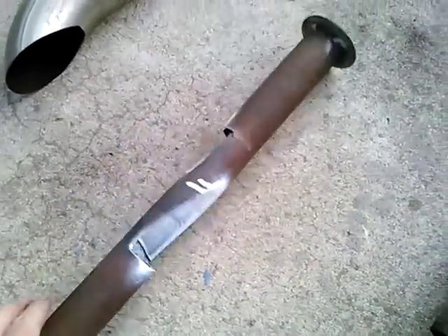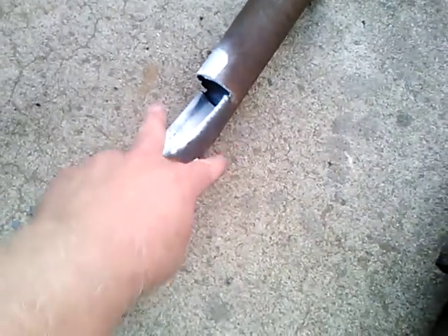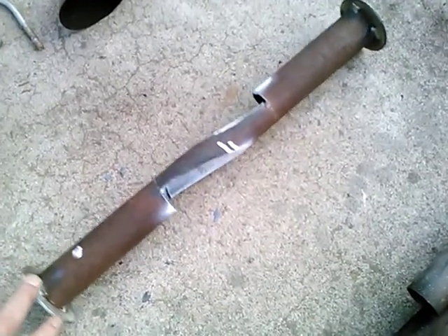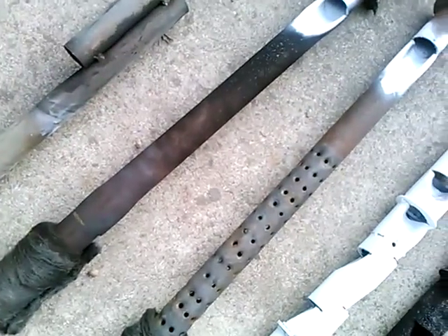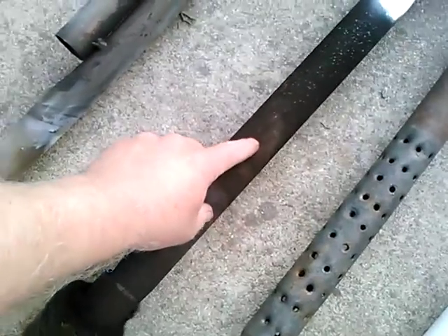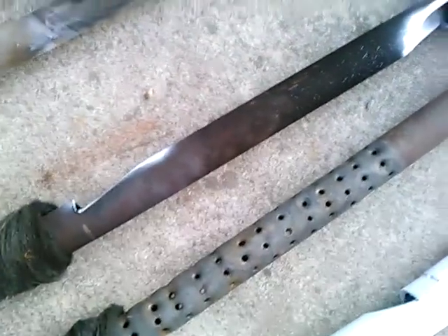The last one I tried is really just a shorter version of that. It's got the scoop and the reverse scoop — 100%, the exhaust has to get into this space and then go back — but they're put close together. This is 18 inches overall, and I really like this sound. I think it's got a little more bark than the reverse flow one. And by the way, this whole length of tube is not doing anything — the exhaust can't get inside here. The thought crossed my mind to put holes in it; it would act like a reverse glass pack. So I might try that someday.